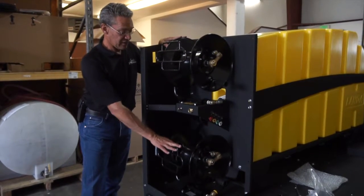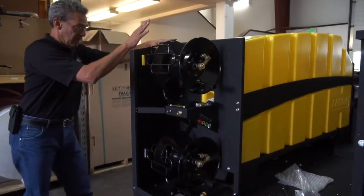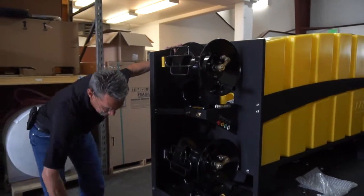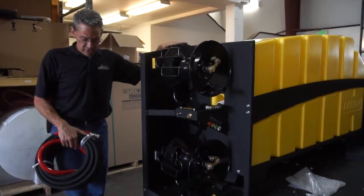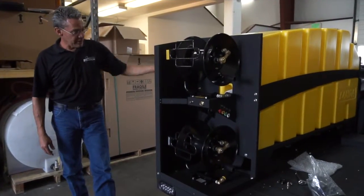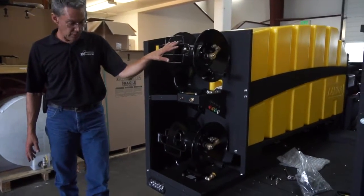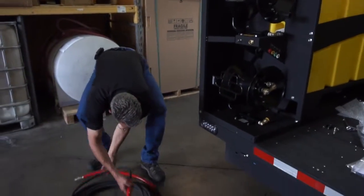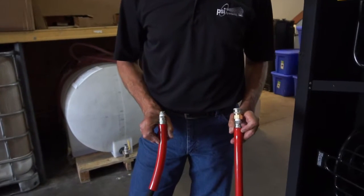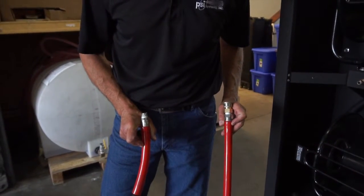The Eco 7000 has a pressure hose reel, and the pressure hose provided is a 50-foot, high-pressure, two-wire braid, 6000 PSI hose. We're going to demonstrate how to attach and wind up the pressure hose on the top hose reel. The pressure hose comes with two red protective rubber sleeves — one is a 24-inch sleeve and one is a 10-inch sleeve. It's important to be sure that the longer 24-inch sleeve is left out, and the shorter sleeve is the one that is mounted first to the hose reel.